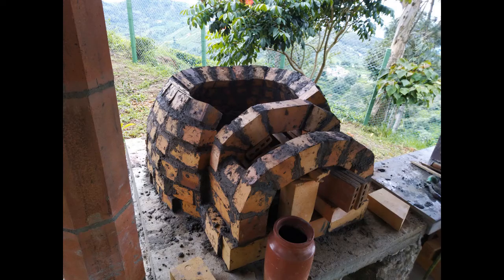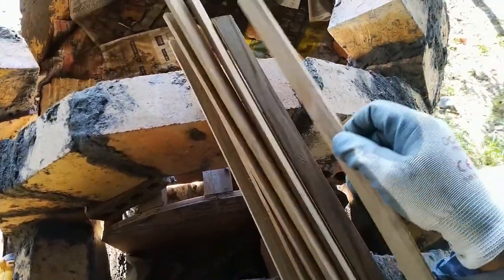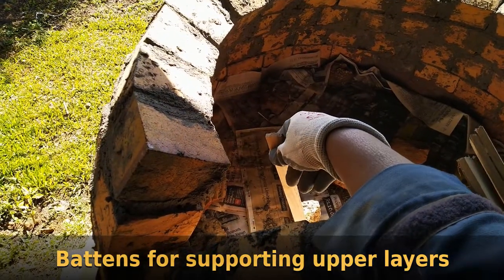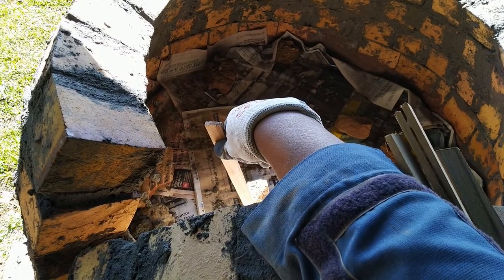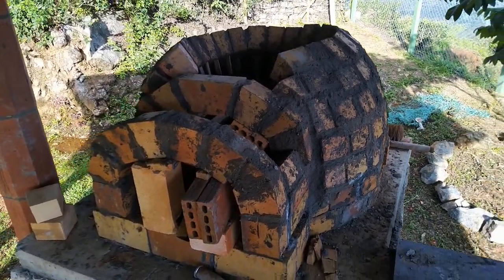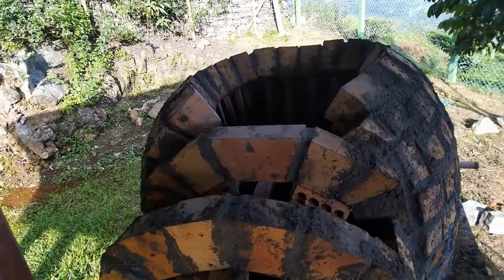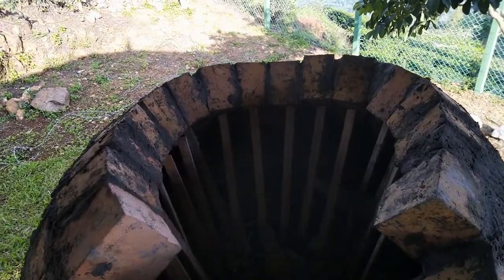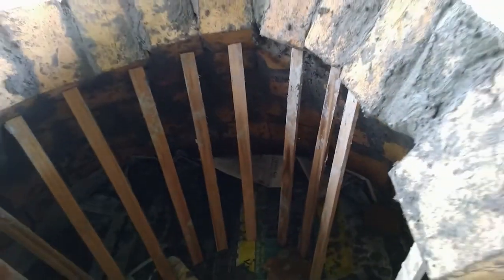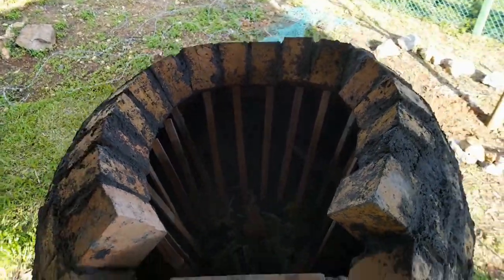Here's the oven from the top. As the dome starts getting more towards the top, you'll notice the bricks curve more and more, so you need to support those bricks somehow. I cut these battens out of pieces of beading, and each brick is just held in place until the concrete sets. I did this for the next two layers. You have to wait until the cement sets before moving on — between layers probably takes about two days — but once set the structural integrity is pretty good.